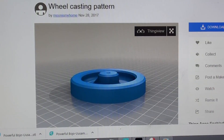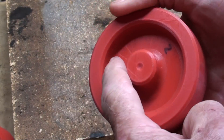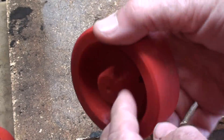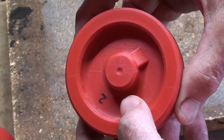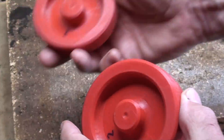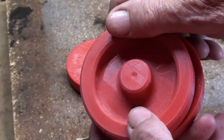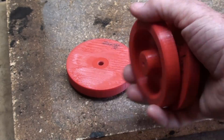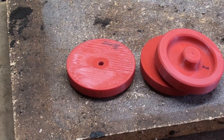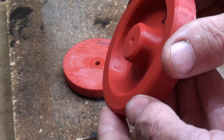I thank Kevin again for doing this for me. Notice I got two pairs of them — there's a beautiful radius fillet and nice chamfers. These are about three inches; there's a set screw boss on one side and not the other, though I may make one without a set screw boss. I'm going to make about four or six of these, two in a mold. This is the first time I've used these patterns — I haven't tested them, but I know they'll withdraw. Kevin put about a three-degree taper on them.